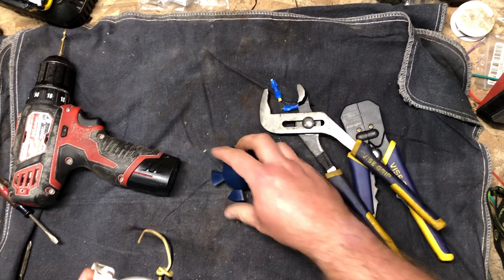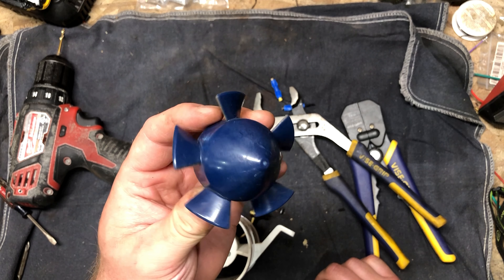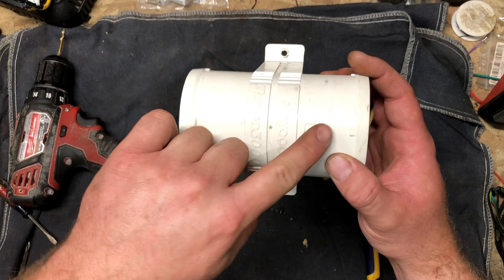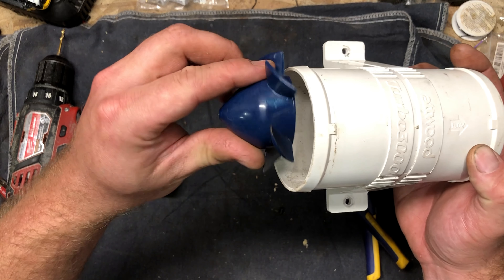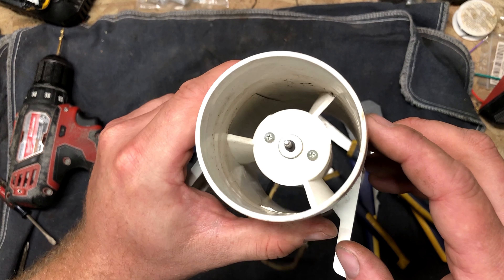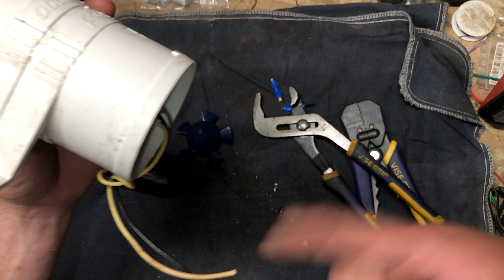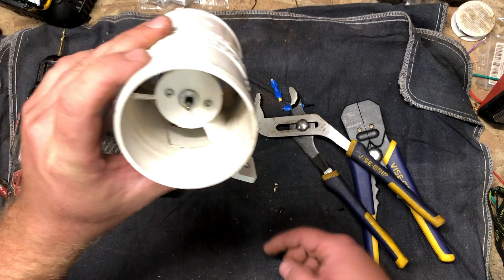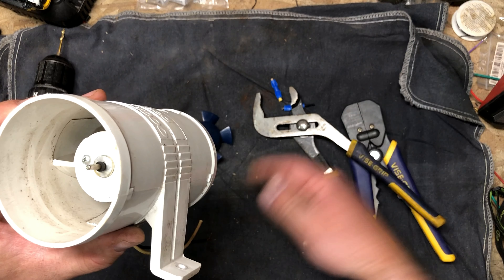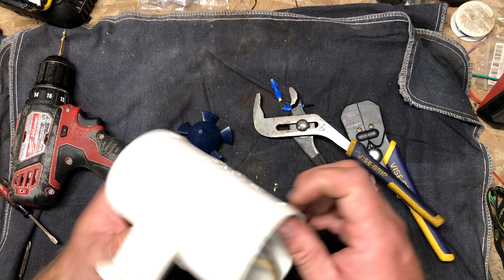Here's the fan. Airflow through this thing is supposed to go in the direction indicated by the arrow, which means the fan is turning this way. We've got a couple of stators behind it to re-laminarize the flow. So instead of turbulent flow coming out of the back, you should have slightly more laminar flow, which means it's going to propagate through the hoses better. If it's tumbling, you could end up with air pockets and air not evacuating properly.